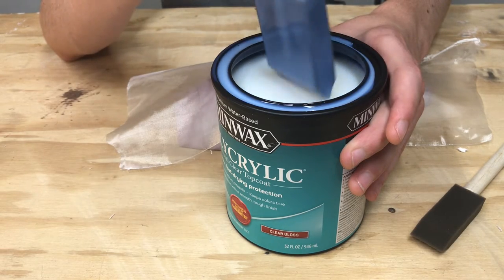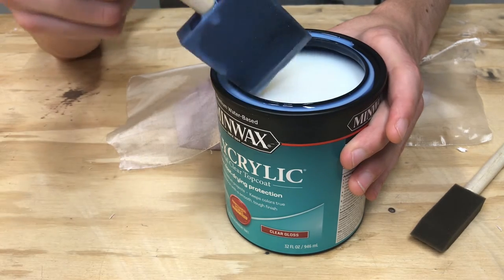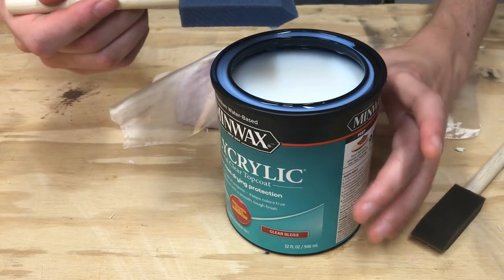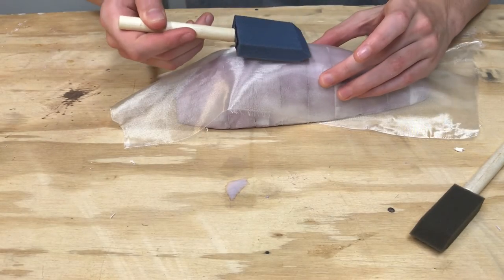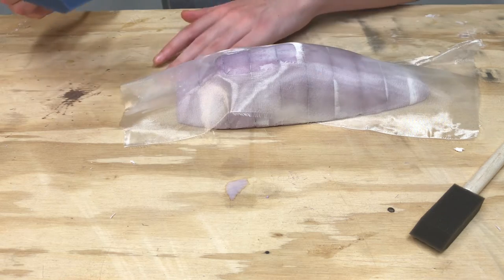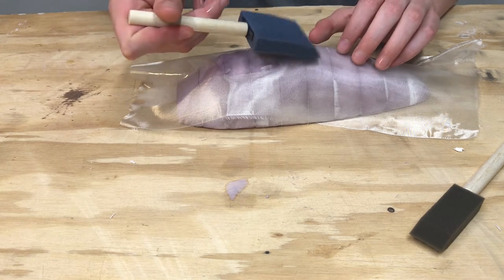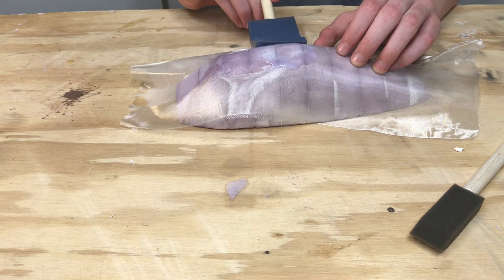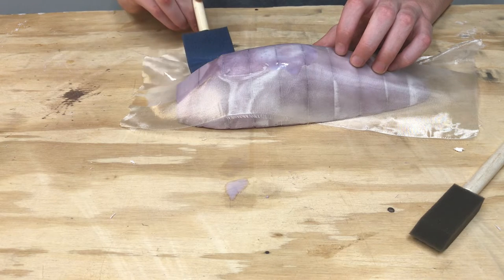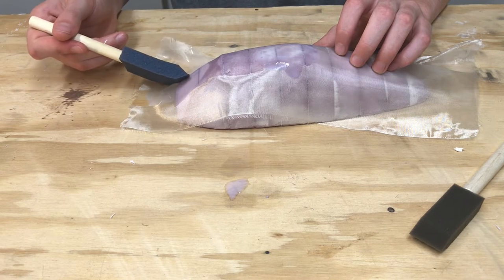These are just foam brushes that I picked up from Walmart — I think they're about a buck a piece. They work very, very well for this type of application. The brush is sort of full, not entirely full. I'll move the polyacrylic out of the way so you guys can see what I'm doing. I'm just going to dab some of this onto the glass for this first little coat. I just want this glass to stick on, so I'm going to use a good amount of polyacrylic, really get it nice and stuck on. Being very gentle with this because this fiberglass does come up very easily — you don't want the fiberglass peeling up in any place.